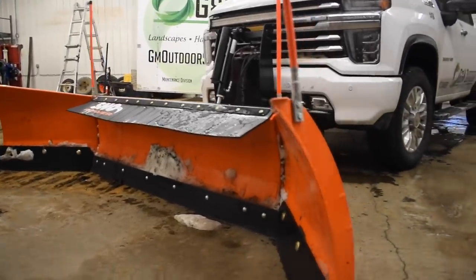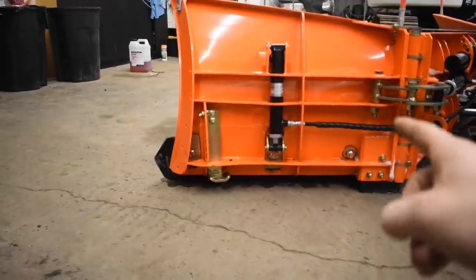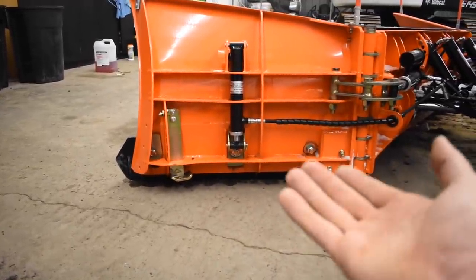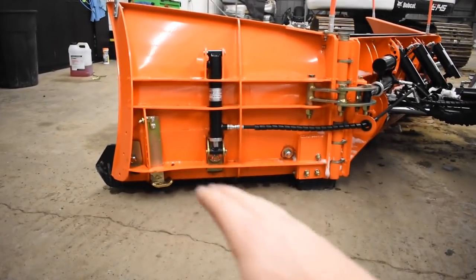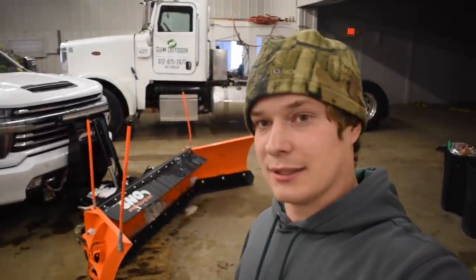The height of the moldboard isn't any issue at all — you can see it's got a nice curl and rolls the snow really well. The first impression is great and I really like this plow. This cutting edge slides and is hooked to a cylinder. In transport, the wing is pulled all the way up so it's not bouncy, which is nice. The main moldboard is pretty vertical so it bites really good — almost borderline too good. I've plowed a few residential driveways and since it cuts so well, it scratched the asphalt a little on a new driveway. Just something to be aware of, but on commercial lots it won't be a problem.